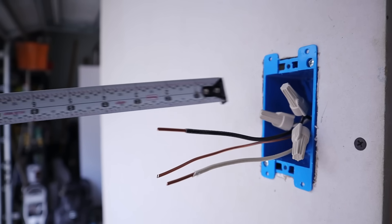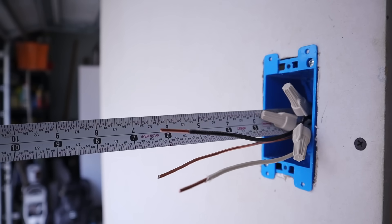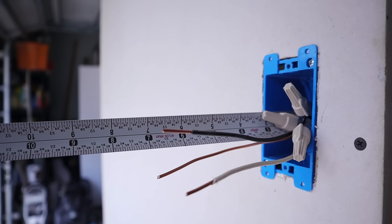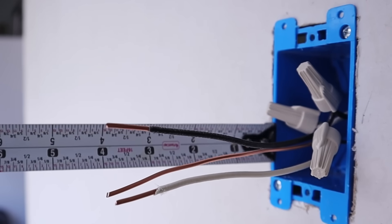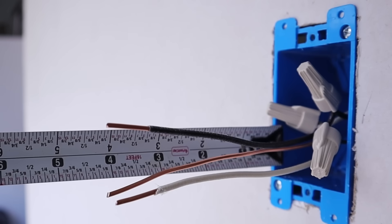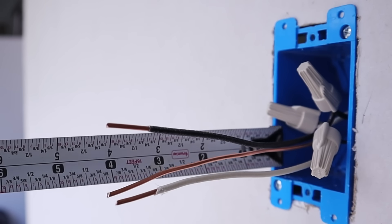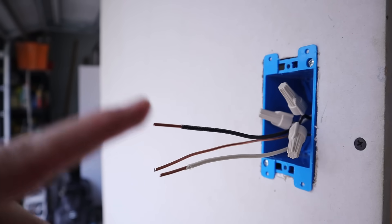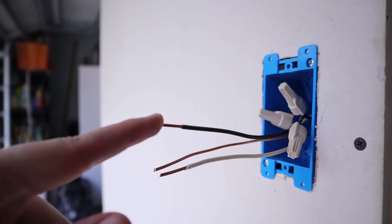Now that all my wires have been extended, I'll measure from where they exit the sheathing in the box — we have at least six inches, actually close to seven. And extending out past the edge of the box, we have at least three inches, actually a little over four. This is a great method, but I'm about to show you a way that might be a little better — it won't take up as much room in the box and won't require as much wire.